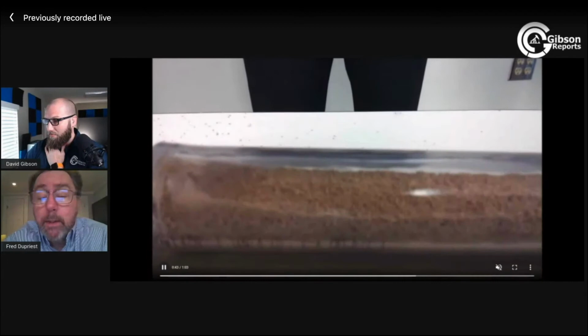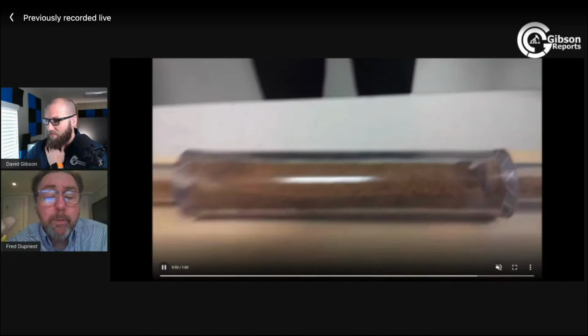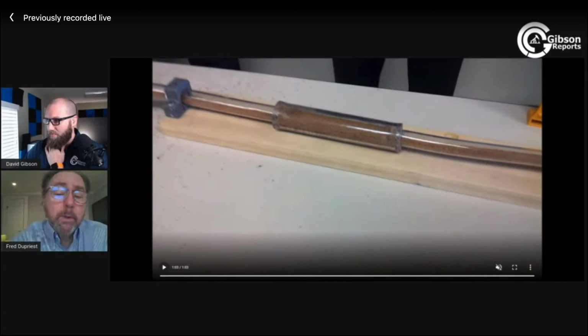And in a drilling fluid and full-scale lab testing, this is what you see. This is real, even with drill pipe rotation. I've seen a video with a pipe turning, I think, 160 RPM inside a bed that's high like that, and the bed is barely bobbling. Equilibrium bed height went down when the pipe rotation was turned on, but the base equilibrium bed was barely moving. Pipe just spins inside of it.